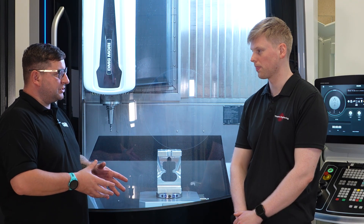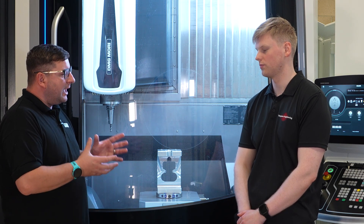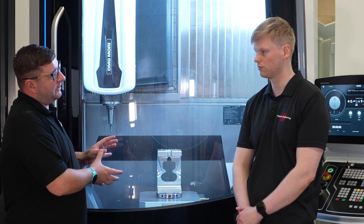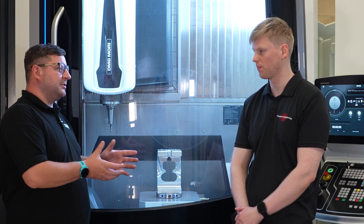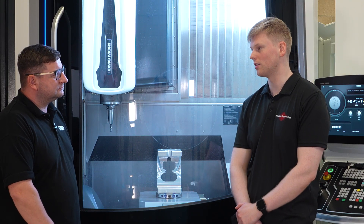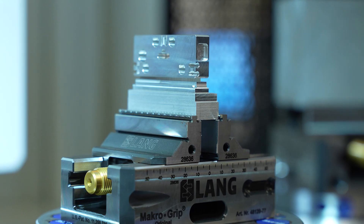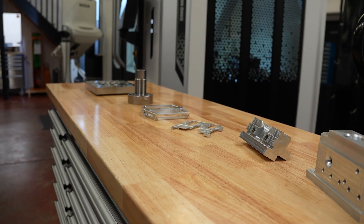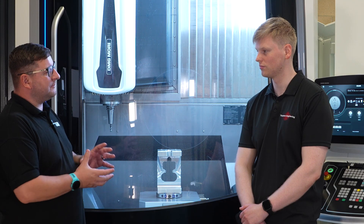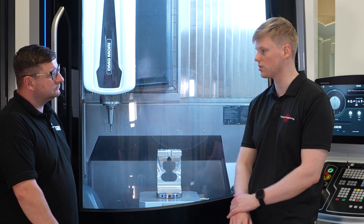I want to talk about tolerances, because you're doing low-batch, high-mix parts which are constantly changing in hole sizes and tap sizes. How do you guarantee that every part you make is going to be to spec? On other machines you'd program the hole, machine it, comp it, and then on the next part you'd have to comp it some more — you'd keep doing that. On this machine it's set and forget. I've programmed one hole at the start of a batch, and maybe four hundred holes later it's still coming out the exact same size — H7 tolerances all day.